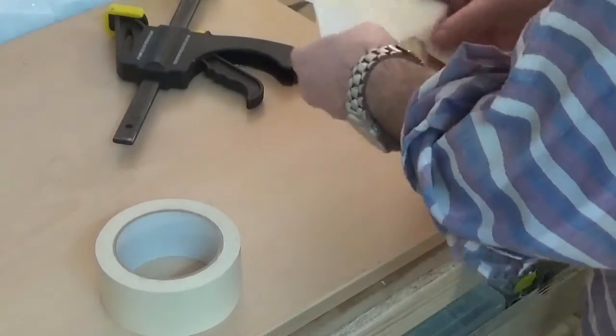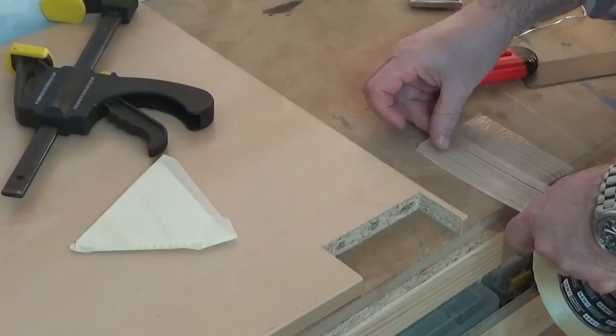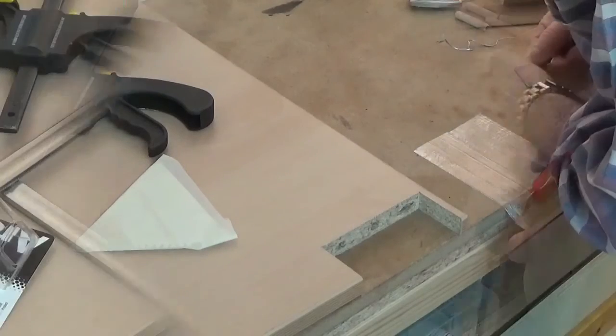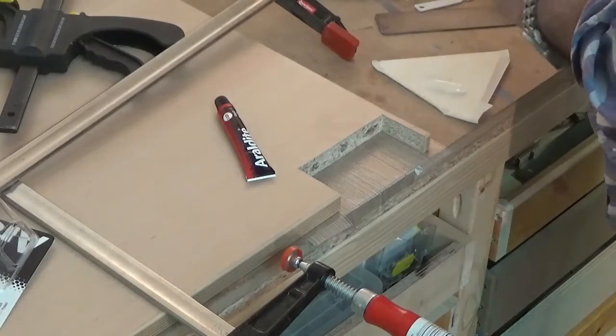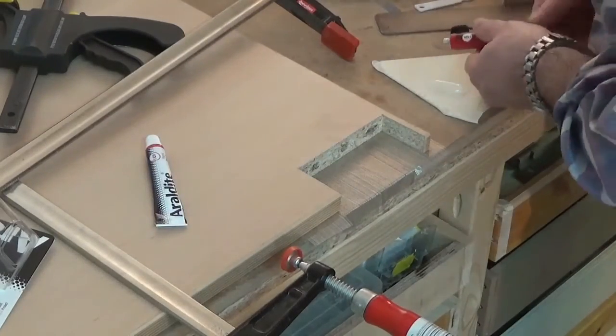Well, three dowels, two pocket screws and two component glue should actually hold the inset in place in a strong manner so that it can withstand the forces that may be applied by attaching the joint or the hinge again.